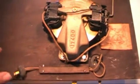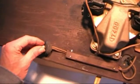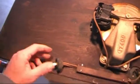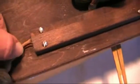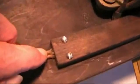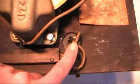One thing to note on the credenza — this is the bottom side of the board, and this is the plug-in that goes to a socket in the back of the credenza. This is one area that usually gets damaged on these wires, right here where it comes out of this wooden block. People that pull on these to get it unplugged put a little too much tension on it, and you can see we've got a little bit of frayed insulation there, so I'm going to remove this wire.